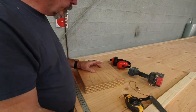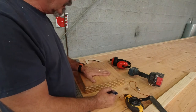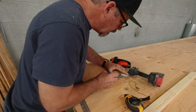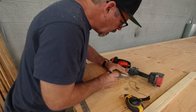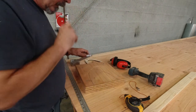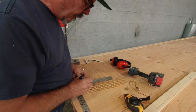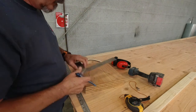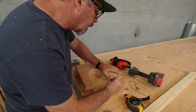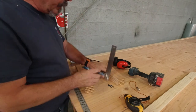All right, so that works out. So I'm gonna use a 17 inch piece and I'm gonna start it 3/16 of an inch off the back of the spar. And I'll start it at the top here. And then this is where I end up on the bottom. All right, what was all that about? All that was about creating this line and this line while these are still together.